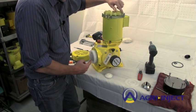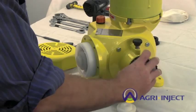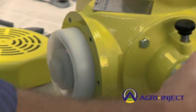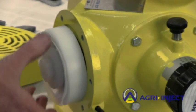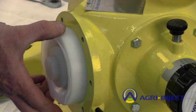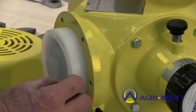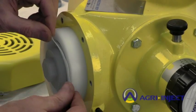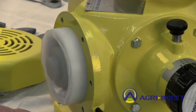As I begin turning, you can see that it is moving back and forth. We are set at a low percentage, so there isn't much movement. If I turn that knob out farther, you will see much more movement between the two. When the cap is tucked all the way in tight, that's where we want to bolt the head on. If it is out, leaving a gap, and we bolt the head on, it will roll the outside edge of that Teflon diaphragm and crimp in the wrong place. So always make sure it's all the way in tight before we bolt the head in place.